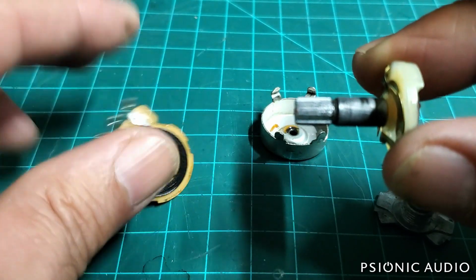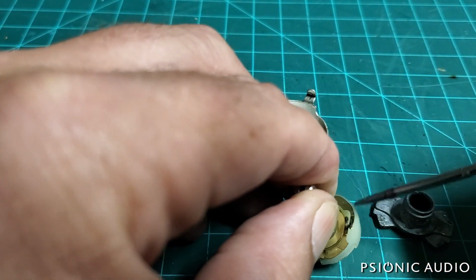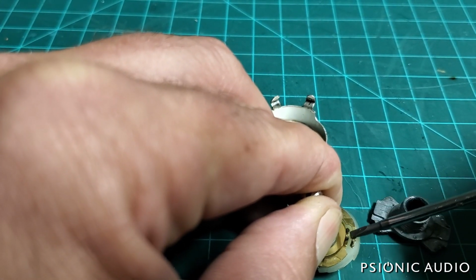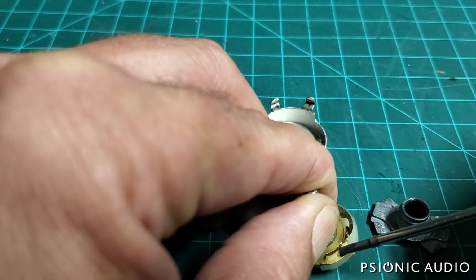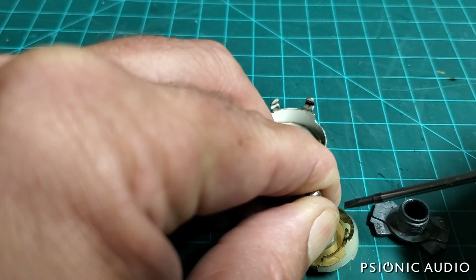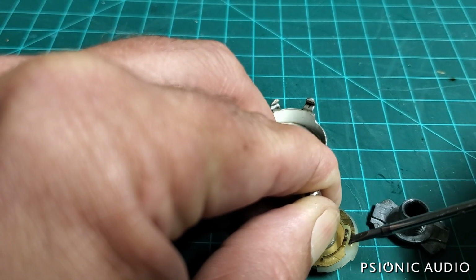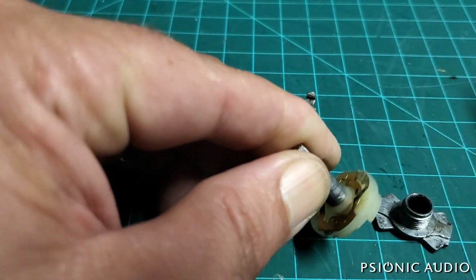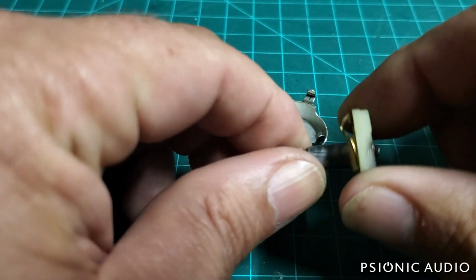And so if you adjust it so they have less tension, and that's just a matter of gently bending the metal down a bit. And you can mess up a pot if you do this and you're not careful. But it's just metal with a little bit of spring tension to it. Most of the time you can do it without messing up a pot. Now that's one part of the puzzle.